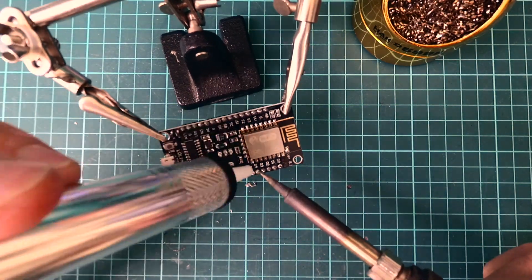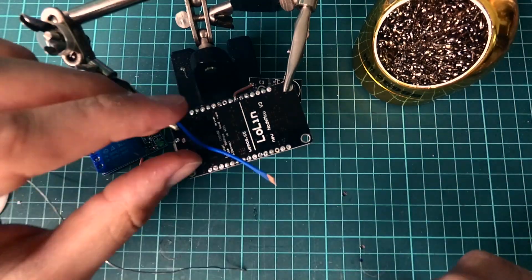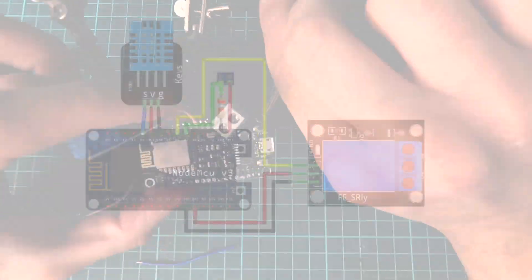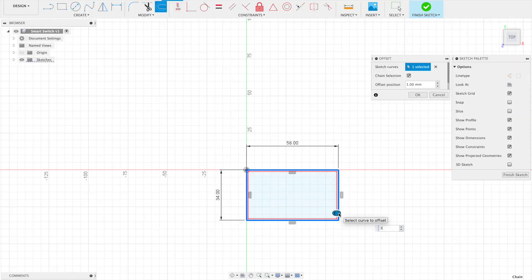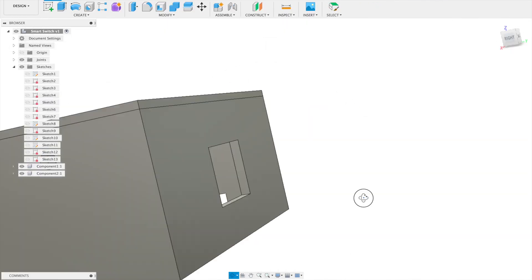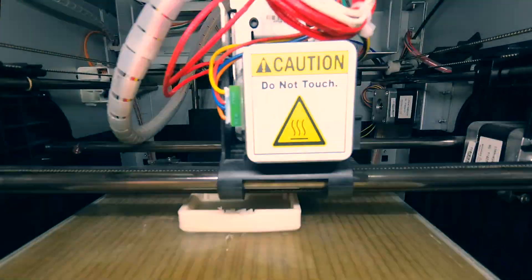You'll also need a physical light switch. Now in order to make this project as compact as I can, I removed the pins from the NodeMCU. Then I soldered all the components together by following this diagram. After that, I designed a box that would hold all the components tightly together, and 3D printed it using my DaVinci 3D printer.